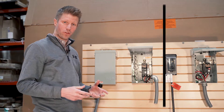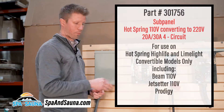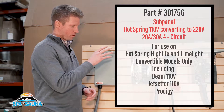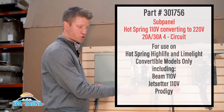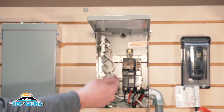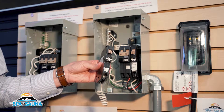You've had your new hot tub installed and wired up, but you've gone out to turn the breaker on and the 20-amp breaker trips off immediately. For your 30/20 five-circuit box, commonly what we see is an issue where the neutral wire coming from your hot tub has been wired to the bus bar and not to the bottom of the breaker.